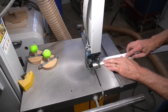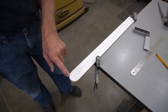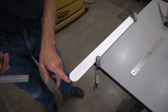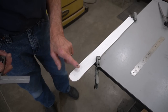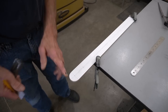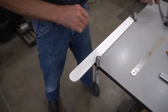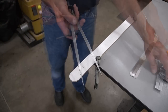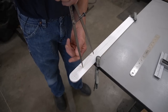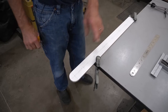A bandsaw and a sanding drum on a drill press make this step quick and easy, but it's just as easy with a jigsaw and a hand sanding block. With a perfect half circle on the end of the template, I lay out the hanging rods — they're going to be three inches on center. I want the first hole spaced two and fifteen-sixteenths from the end, which allows a sixteenth of an inch of space for the arm to pivot up and down without rubbing on the cleat at the back of the drying rack. With that first hole laid out, I set dividers to exactly three inches and step off the other five holes, giving me six center marks for the six hanging rods.